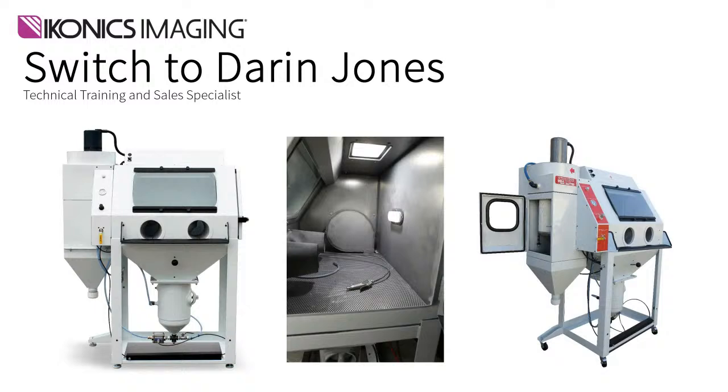All right. Thank you, Darin. That is outstanding, and that is a great point. With the laser technology, we just don't have the ability, especially on materials like granite, to produce that depth. So many people want to do photographs on granite, and it does a great job on granite with the laser system. However, to produce that depth that can handle the outdoor environment and salt sprays and UV, as well as acid rains and stuff like that, sand carving is definitely a better method and is going to give you many, many more years.